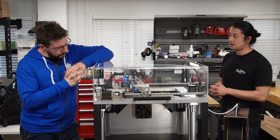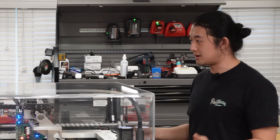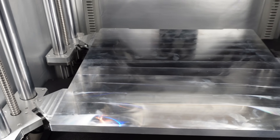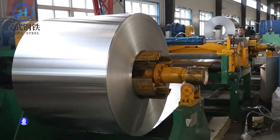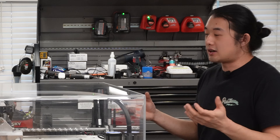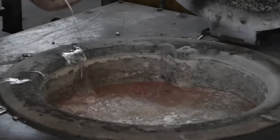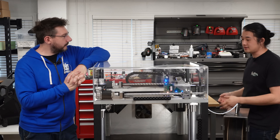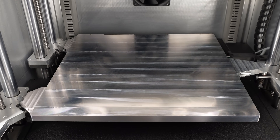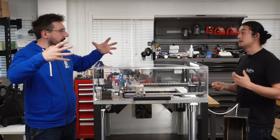Let's talk about the entire build tray. We've got textured and smooth PEI, which makes removing big parts much easier. That's sitting on top of an Alka 5 build tray. Normally aluminum like 6061 — aerospace aluminum — is made by rolling it out like dough, and because it's rolled, it has internal stress, so when you heat it, it curls up. Alka 5 is a cast aluminum product — imagine a giant loaf of bread but aluminum the size of a shipping container. You take slices off, and because it's cast, it has really even stress, so when it heats up it doesn't twist — it expands incredibly evenly.